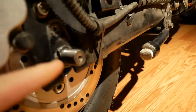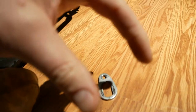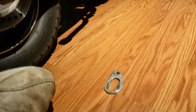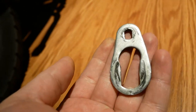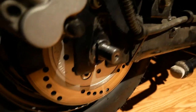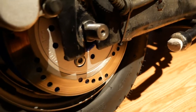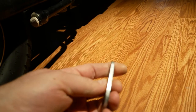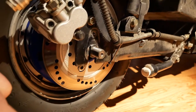These two flats down here sit on the flats on the shaft, except they do it on the wider part back here. The flats would sit on there and then under acceleration it would slowly open those flats up. I noticed a couple days ago they were more like a V-shape. I've since put this in a vise — same thing happened on the one on the other side — and closed them back up to make them parallel. But one thing I couldn't get rid of was that slightly lobed shape; you can see it's definitely twisted. It's also been working on the dropouts in the swing arm — there are a couple places where the ends of the flats are starting to wallow out the flats on the dropout arm. I've got some 4140 steel coming that is quarter inch thick and much wider, so I've got a lot more beef. Hopefully that will arrest the torque I'm transmitting to the frame so I don't have this problem anymore.